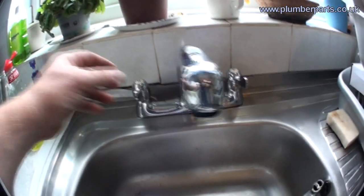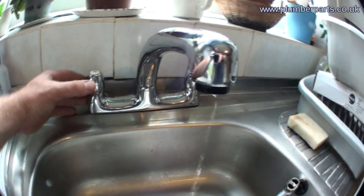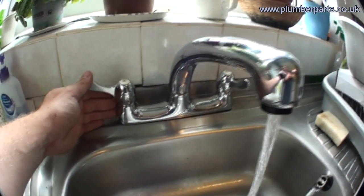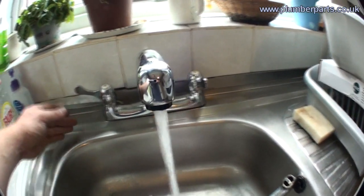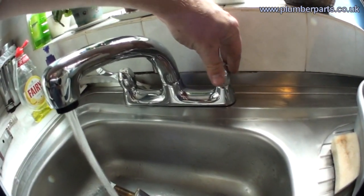Once you've gone through the agonising process of tightening both of those up, you can then turn the water back on and test for leaks — with any luck you should be done. The water's all back on so let's test for operation. You should get a bit of air in the hot side. A little bit of air coming out — test for cold.